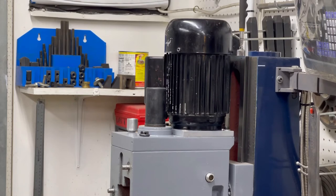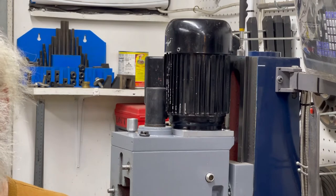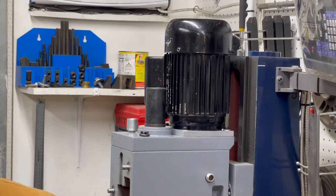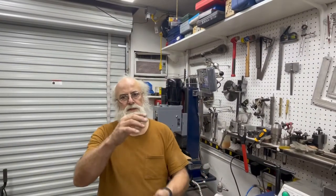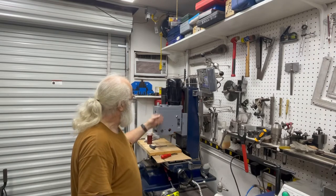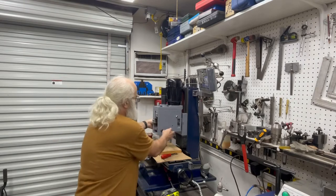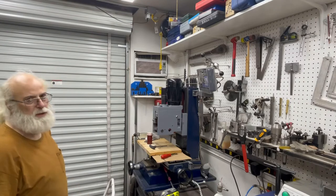So, just for general information, you don't need to take it apart to get the Quill out. We'll see that at the end. The Quill comes out without any of what I've done so far. So, as a reference in the future, if it gets loose, like mine did, where this guy would go up and down, all you gotta do is take this bottom area out and drop the Quill out. You've tightened it up, put it back in, it's about an hour's worth of work.